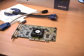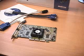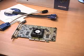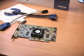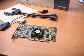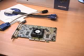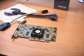Also, there is a 16 times FAA, that's fragment anti-aliasing, and what that does is it's going to have very low impact on 3D performance, but it will clean up all those jagged edges. Another technology in this is called Glyph, spelled G-L-Y-P-H, anti-aliasing. This is actually hardware anti-aliasing for text. What it does is it makes text really sharp, and you can also do font rendering with gamma control. So again, some amazing 2D quality aspects to this card.